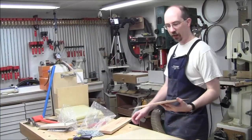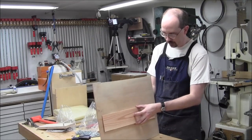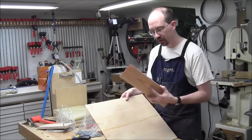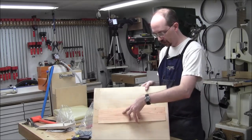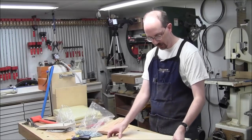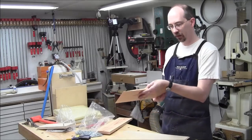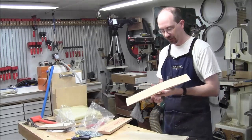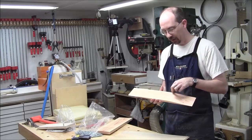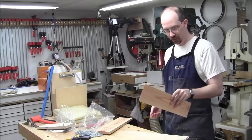So we separated that, and now this will go sort of nicely down inside of here. But you get kind of the idea that this will go in here, and then all of this gets mushed down pretty flat. But the first thing I got to do is kerf it. And really, the kerfing only is going to leave a solid web right around in here. All of this will become little flimsy strips, so we're going to do that next.